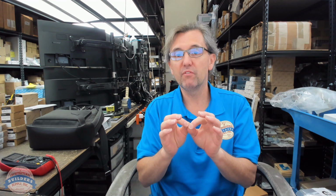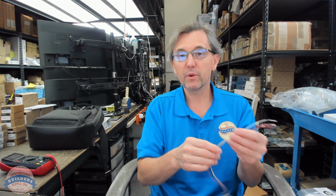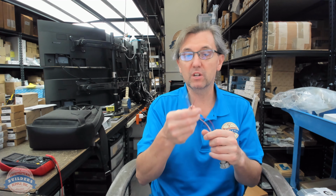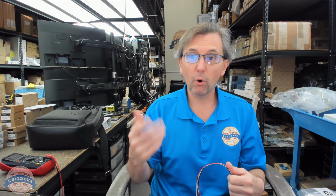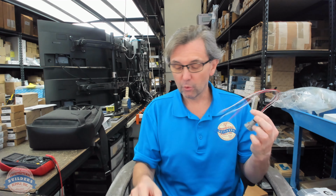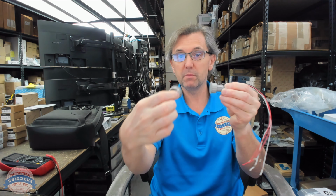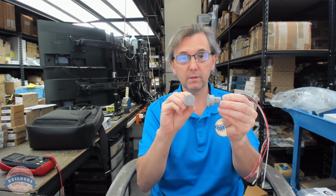That multimeter is literally going to send a micro amount of voltage into the wires. So the wires will be connected together in such a way that the circuit is either open or closed. Open and closed is a fancy way of saying, are the wires connected or are they disconnected? The way that works in a door position switch is you have 2 pieces that come together when the door is closed, and then they're separated when the door is open.